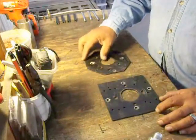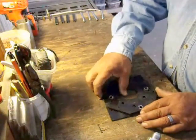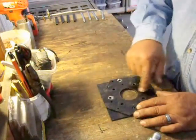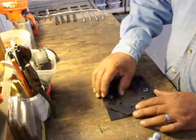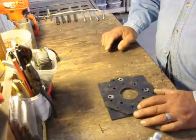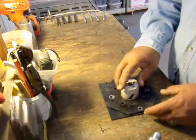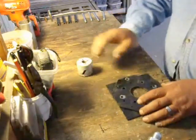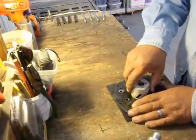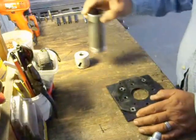Okay, now you know where your motor and your pump is going to be. Align your plate and your other plate that has the pump. Make sure they're going to line up right. Then you're going to put these back together again using the self-tapping screws for alignment. Make your mounting holes so you can bolt them together. Make sure you have your alignment right. You can use your two-inch hole saw for alignment, or preferably a metal two-inch pipe.